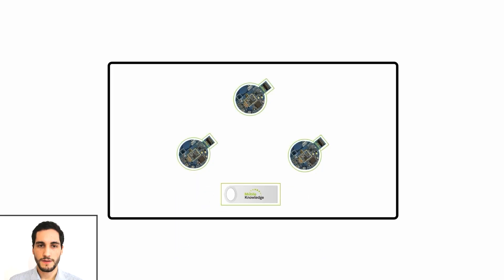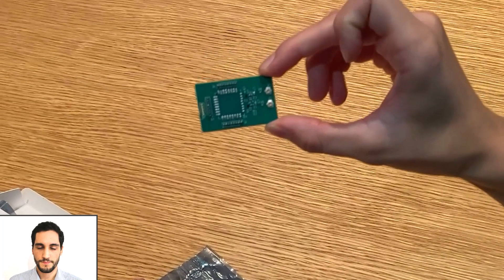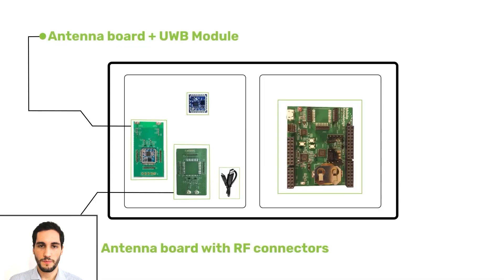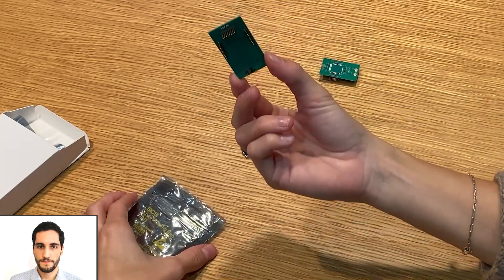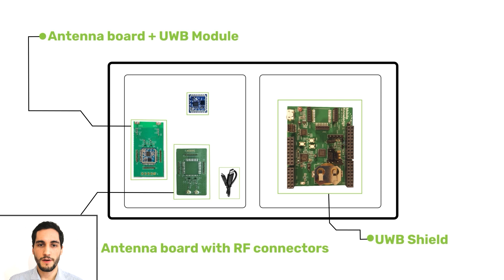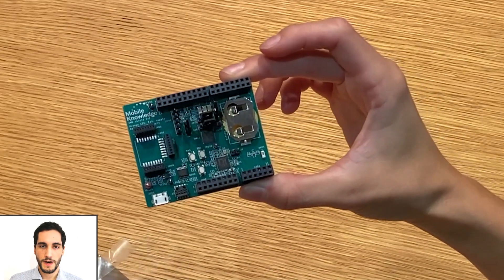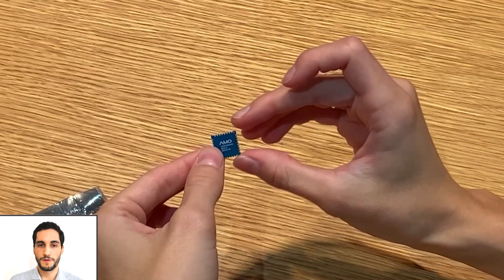The kit also contains an antenna board with antenna connectors and footprint to assemble an ultra-wideband module. You also get another antenna board with a pair of SMD antennas and an ultra-wideband module on it, ready to be used. You also get a shield with a socket to connect an antenna board with a module on it, and finally a spare ultra-wideband module that can be assembled into your own design.